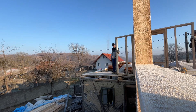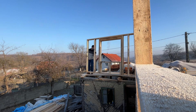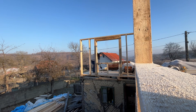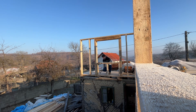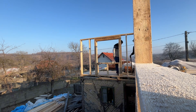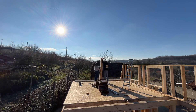Here we were sliding the wall in — first of all, our bedroom is going to be right here. This could be the window looking out basically over the property. So first I had to slide this wall in and tack it down. We'll have to put some shims in later underneath to get it nice and solid all along, because right now it's running along on top of those beams in the house. We got it tacked down and then got started with our addition roof.